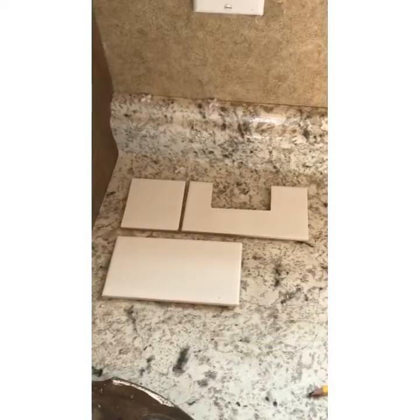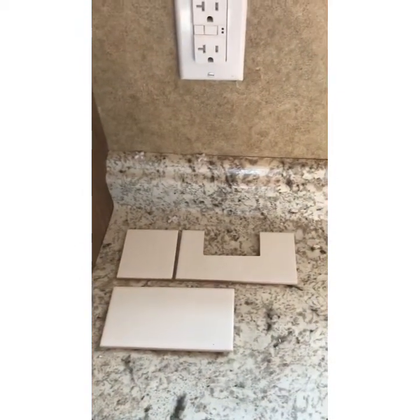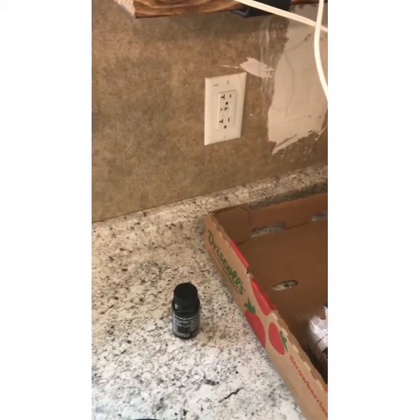So we'll figure out whether we're going to cut the tiles on the very top or just make the grout lines longer on one side, staggering it so the very top will be even. Quick update — here I am outside with a tile cutter. I got the trim up around the window so I'm ready to start tiling. Cut the first two little pieces that go around the outlets — one was a straight half cut and the other one had a cool little notch in it, like a little U. So I'll pause at that point, recut the next — whether it be a U or two edge pieces — and move on from there.